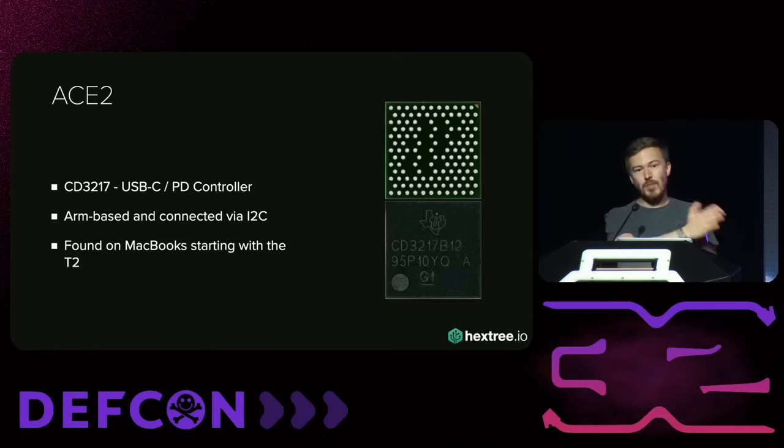This activity could be anything — the power rail, the SPI flash line, or something else. But it's something. The idea is simple: we start recording the spectrum on the HackRF, reboot the ACE3 using the ACE tool, and get the electromagnetic recording. Then we do some DSP — which took the better half of a week — filtering until eventually I had a line that might tell us something about the chip. The HackRF has hardware trigger inputs, so we can trigger the recording using a hardware signal. We use the chip select line on the flash as our trigger — the chip select line will go low just as our firmware is being loaded, which is perfect to offset a glitch from if we want to bypass secure boot.